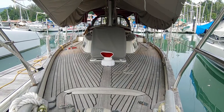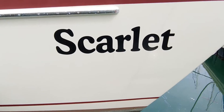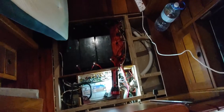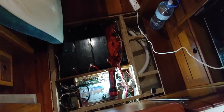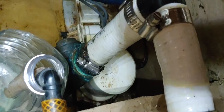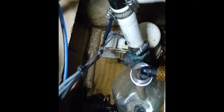Today's task is to install a new bilge pump. The old installation had an electric pump and the manual bilge pump sharing the same hose, which is not a good idea. I will be installing a new hose dedicated for the electric pump and also a new electric pump. The old pump has quite a complicated hose installation — I'll be removing all of that and installing a simplified connection.